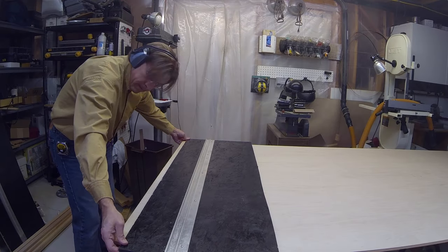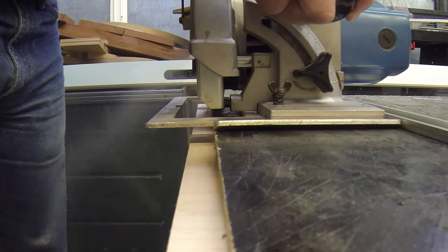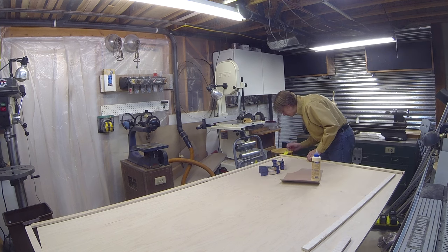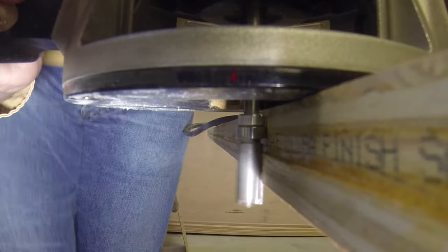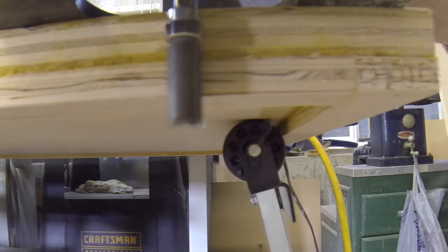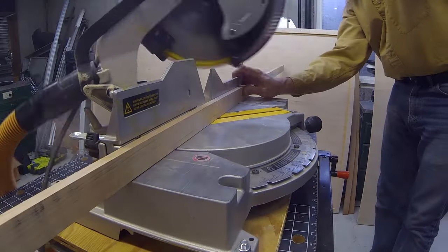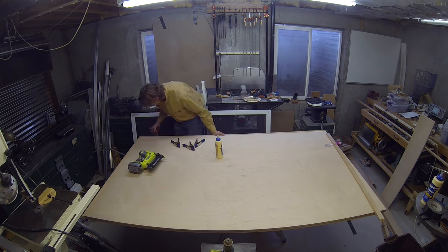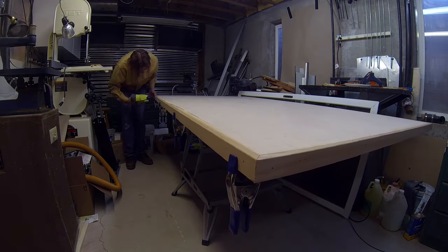I started with a 4x8 sheet of plywood. This was several inches larger than I needed on both the length and the width, so I cut it down to size, slicing it off in thin strips. I then glued and tacked these strips to the bottom side edges of the tabletop to give a little more substance for the edge banding to attach to. I mounted these a little bit proud of the edge, so when the glue dried I could use a router bit to make the edges flush. My wife has some poplar trim in her sewing room, so I cut some banding out of this for the edges to improve the looks, protect the exposed plies of the plywood, and to tie the different elements of her room together. I then glued and tacked the banding to the edge of the top. And then the project sat, and sat, and sat.